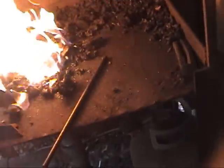Whereas if you look at some of these underpieces, they're bright cherry red, no longer giving off smoke if I pull them out of the fire. This is pretty much pure coke at this point. That's the stuff we want. This is the stuff we're trying to get rid of. But there's enough nice glow in there now. I think we can go ahead and get to work on our pieces for the day.